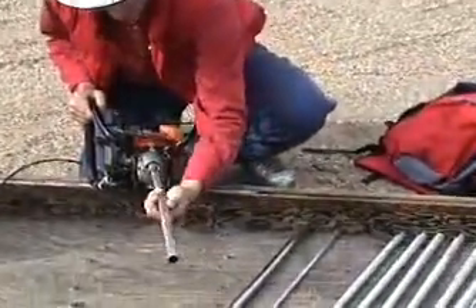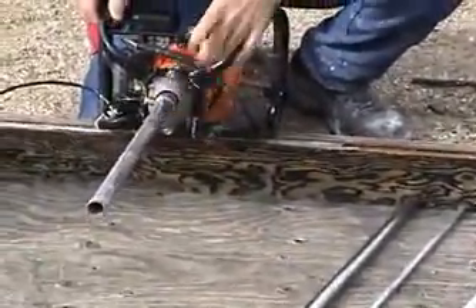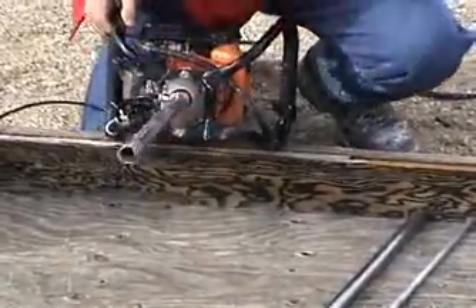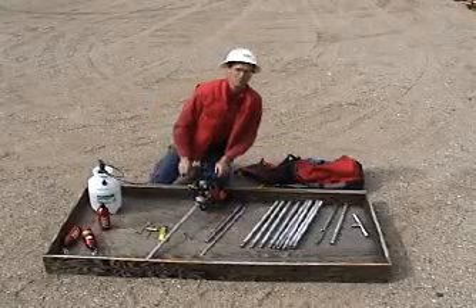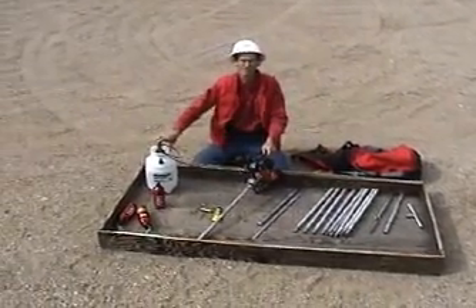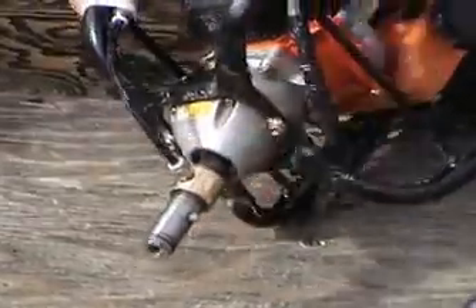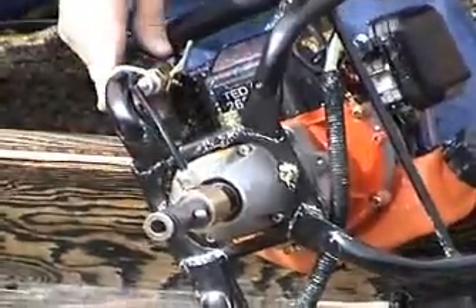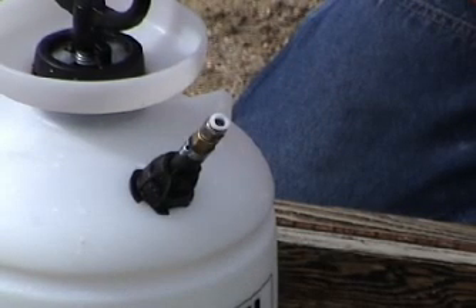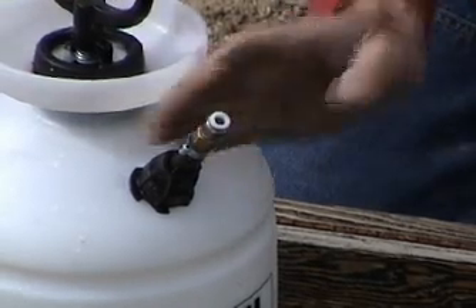It fits on a quick and easy to use bayonet system, with two O-rings to seal the water in, because the water is actually pumped down through the stem to the core barrel. What the Shaw Backpack Drill folks have done is include a pressurized water system that drives the water through this rotating water swivel — very much like what you find in professional diamond drilling arrangements, only lighter, more portable, and affordable.